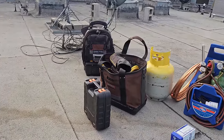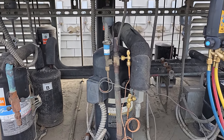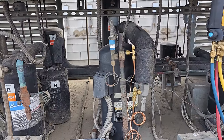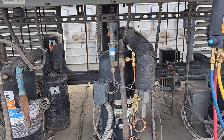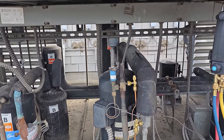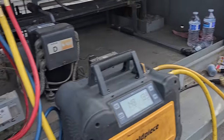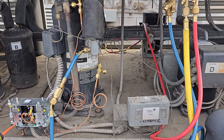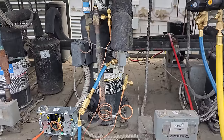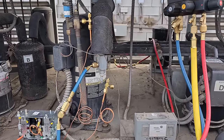We are back — it's been a while. We brought our entire van, got someone with me, and we're going to recover the charge out of this guy and get this compressor swapped out. I was not able to get a RotoLock compressor, so I have to use RotoLock adapters. It was really hard to find this compressor — nobody local in Southern California had it and even Copeland was a couple weeks out. We decided to go ahead and recover and put new refrigerant in this — the refrigerant smells funny, which could indicate the compressor is on the verge of catastrophic failure. The overheating inside could have damaged something, so we're going to change the refrigerant, dryer, and the whole compressor.